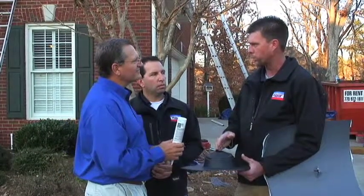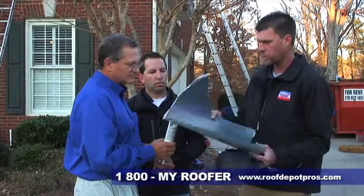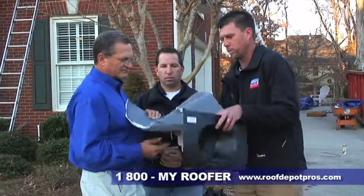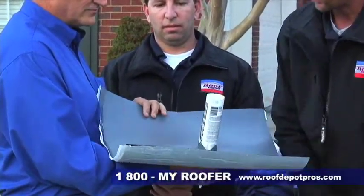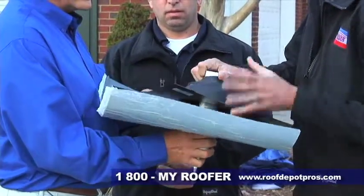The standard roofing process is they'll shingle up to the pipe and just slap this boot on there, call it a day. That's not enough, unfortunately. This rubber grommet is a weak link. It rots out. It only takes a few years to happen. Our process is we'll shingle up to the pipe. We will install this piece of storm guard around the pipe. If I can get the pipe through there. There you go. Like so. Then we will install the pipe boot and shingle around it.